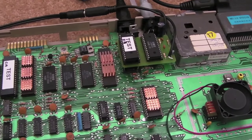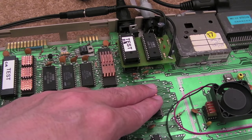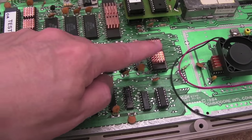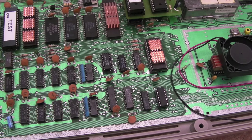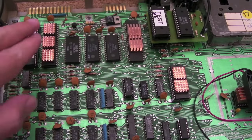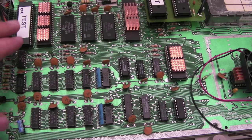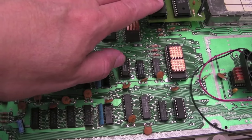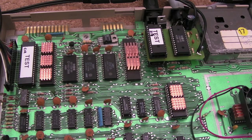Is this a PLA issue? I needed to take this PLA off here because I've not got a PLA on the other board. I thought: sod it, it's always nice to have the PLA socketed. So I socketed the PLA and swapped it out — just the same. The PLA has got nothing to do with this. Coming back to the 4066, the diagnostic card error homed in on the POTX and POTY on the SID when I looked at the schematics again. One of the first things I did then was take the SID out and test without it — same problem. Last Ninja 3 skips the intro even with no SID in there, so at that point I kind of ruled the SID out.